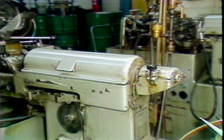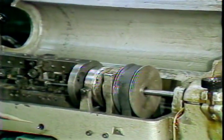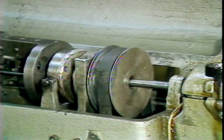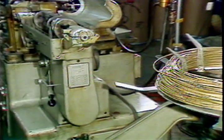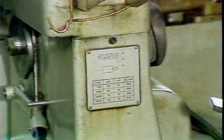The rotating speed of the rotor in the stock straightener will also have to be changed during setup of the Model D2 and D4 Escomatics. There are 4 possible speeds for the rotor: 700, 1400, 2800, and 4800 RPM. This chart on the rear of the machine shows a list of pulleys and belt combinations and speeds.